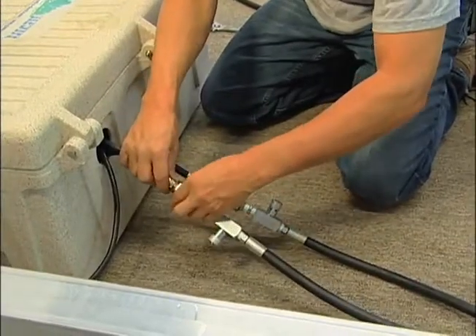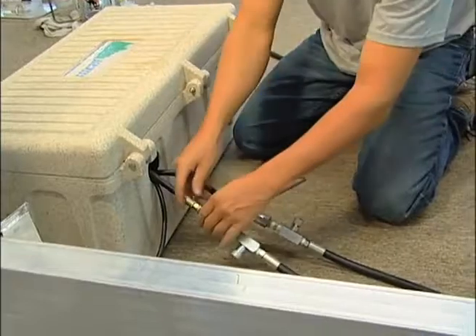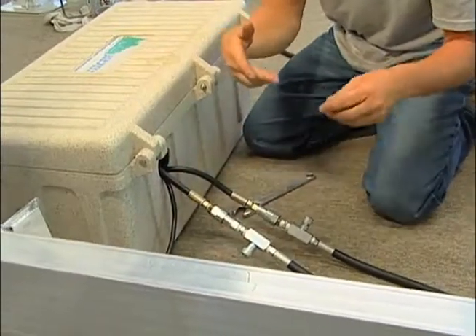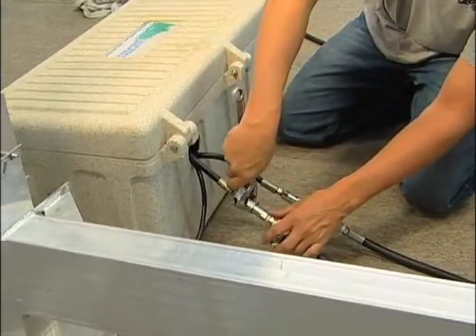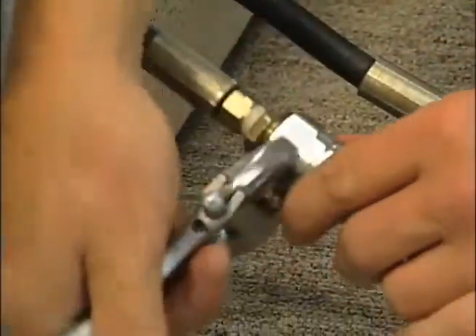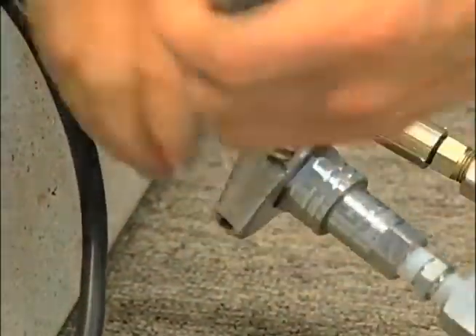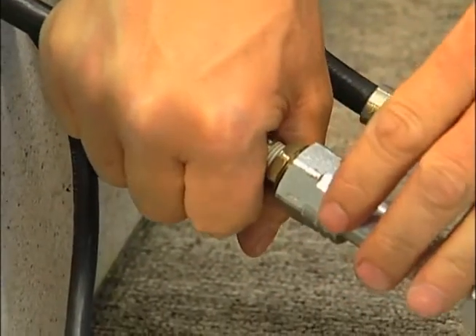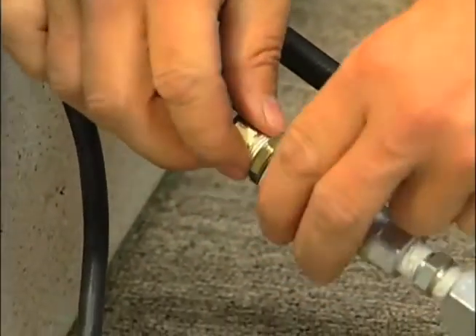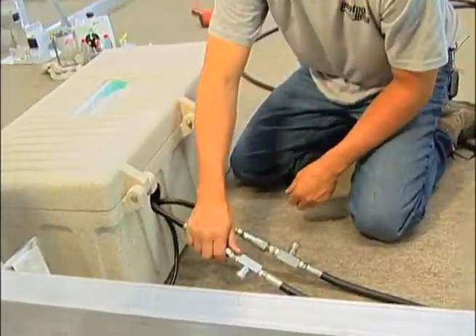The pump uses a screw coupler. Once it's tight on the snap ring, just to make sure that it pushes in if it's had a little pressure under there, use a wrench and turn that fitting so that it does seat itself fully into the hose. If you turn your lift on and nothing's moving, chances are that coupler didn't get tight enough, so get a wrench and tighten that up.